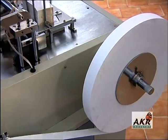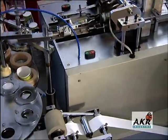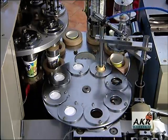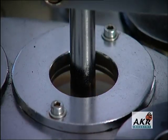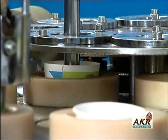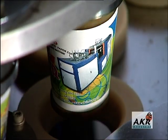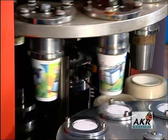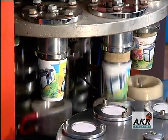In tandem, blanks are punched out from a bottom-fed roll and formed into the shape of the cup bottom. The cup bottom piece is inserted into the cup body, and both are rolled together at the lower portion of the cup to form an integral leak-proof joint.